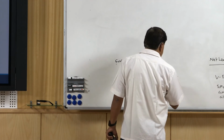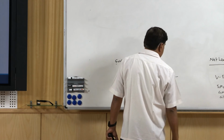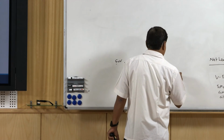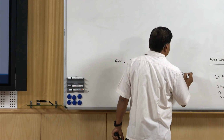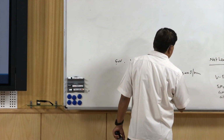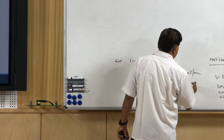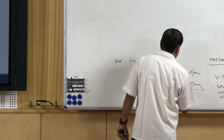So, it is common, since this quantity comes out to be more like 6000, and if 2 mm per second is being used, then it will be 3000 joule per mm. So, normally it is common to express like 3 kilojoule per mm heat input.